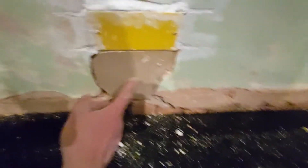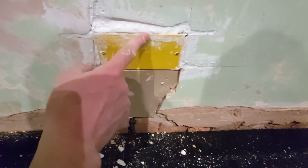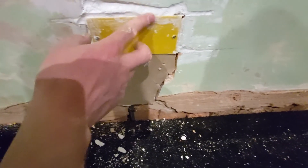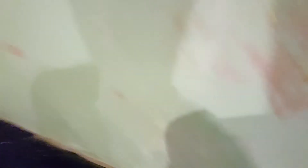Obviously the room needs clearing and emptying before I do my plastering, but I bought everything I need — which is what that thing's for as well, although it's far too big but we're going to make do. I learned at my plastering course you can't plaster onto brick, so I got some plasterboard and I've cut that to shape and glued that in. I filled this gap a little bit as well with some wall filler ready for the plastering, because you can plaster onto that. So yeah, next video we'll be plastering — see you then, bye!